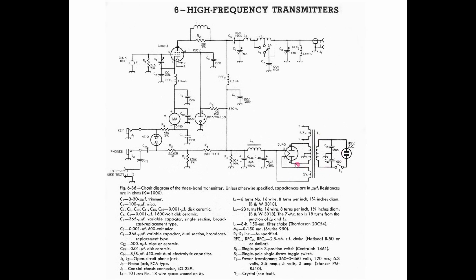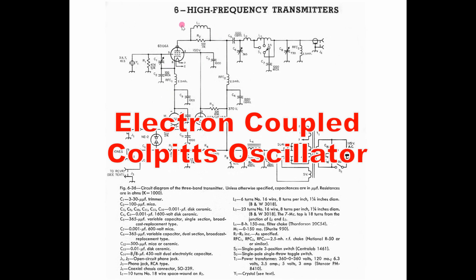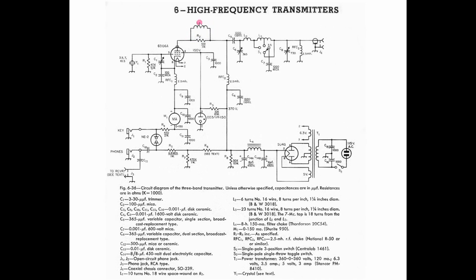The power supply is very simple — a full-wave two-diode type system, regulated only by the VR tube. The high voltage, 370 volts, is put on the plate, and 150 volts is on the screen. The oscillator topology is a Colpitts — an electron-coupled Colpitts oscillator. There's a parasitic choke arrangement to reduce high-frequency spurious emissions that would interfere with TV. A conventional pi output network with an added capacitor at the lowest band, 80 meters, and a choke on the output for safety should there be a failure of that capacitor — high voltage would be presented to the output, shorted by the choke, which should consequently blow the fuse.